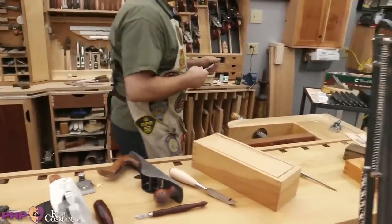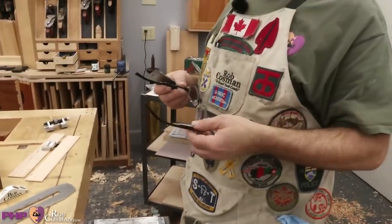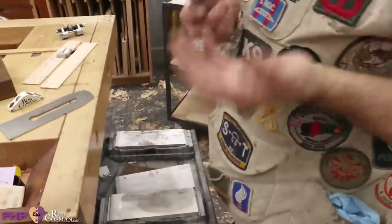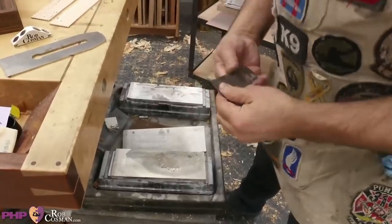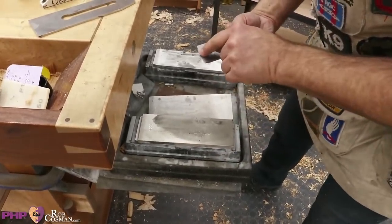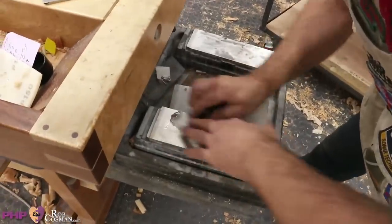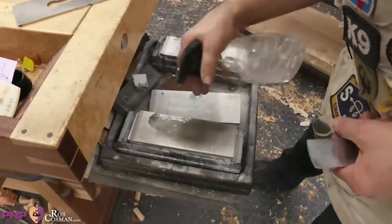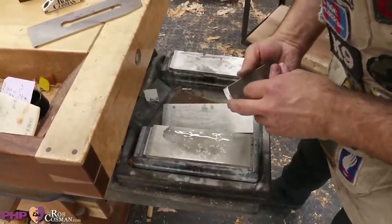Now this is another time when you're going to want your diamond plate, and this is like sharpening an axe. I can't think of a reason why I would spend the time to polish my axe up to 16,000 grit. And this operates like an axe in that you're just using it to hog off material. So the back of the scrub plane blade is going to be done the same way a chisel's done. No ruler trick. If you did a ruler trick on this, you'd end up with a little flat spot out here, and you wouldn't touch there because of the radius on the end of the stone. So you can go all the way through, polish this flat, take it right up through the grits. Oh, yeah, that's right, too. I was talking without thinking. You can stop at 1,000. And you don't even need to flatten it. You just need to remove the burr.